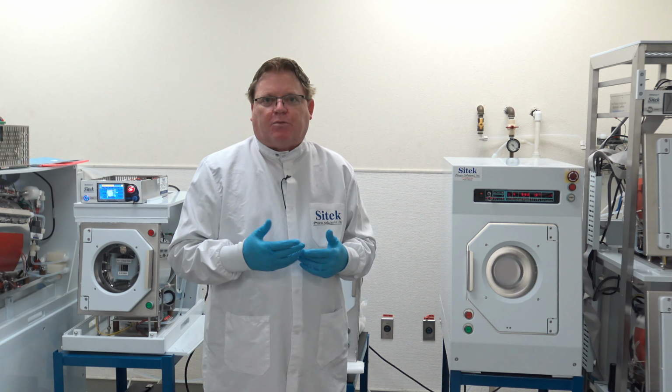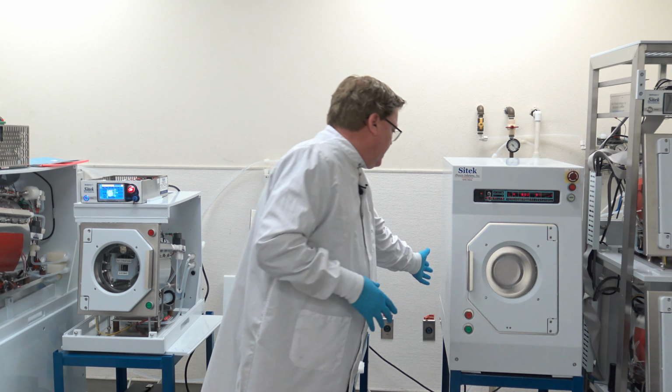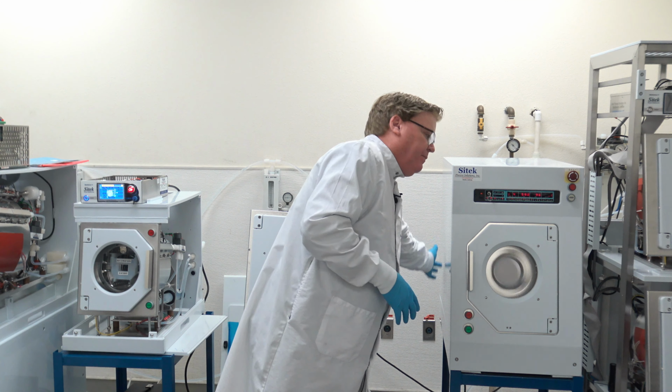Okay, we have about a minute left on this. At the end of this process, what happens is called the RSP, rotor stop positioner. It's back behind the motor. It actually has a cylinder that will shoot out and roll against the cam assembly. It finds a flat that will upright what we call home position, which is 12 o'clock. When that happens, I'll be able to hear the door release and be able to open it.